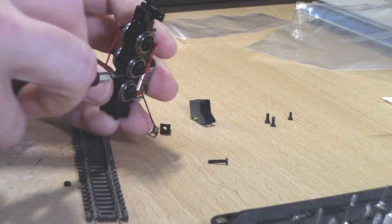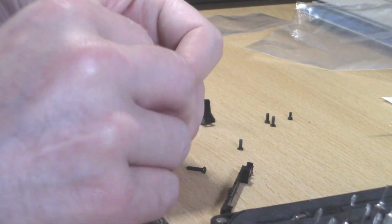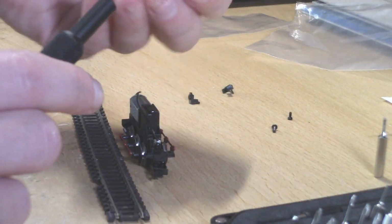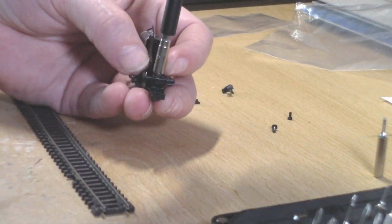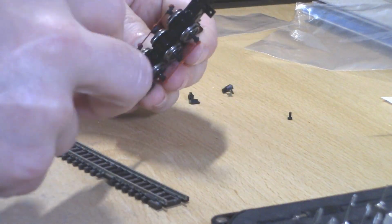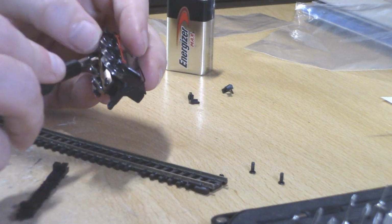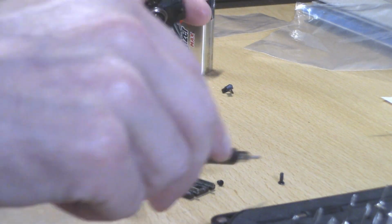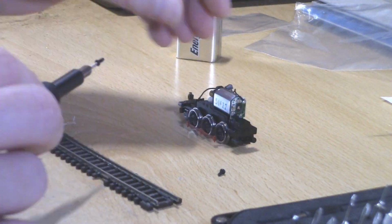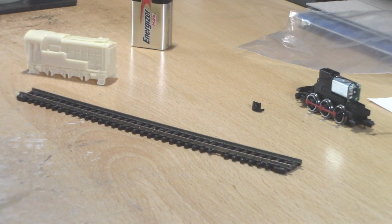After a few teething problems, the class quickly proved the advantages of diesel-electric shunters in terms of effectiveness, cost savings and driver comfort. Although at £7,275 they cost £1,100 more to build than a Z-class steam locomotive, each one saved about £1,700 per year in operating costs. They could be used continually day and night for 6 days each week at Norwood without any service requirement beyond refuelling. They were, however, found to be too slow for the secondary task of freight transfers around the congested passenger lines in the London area, although perfectly well suited to this traffic on rural lines.